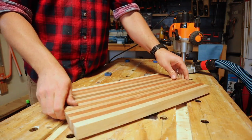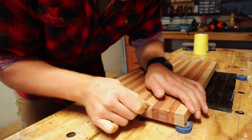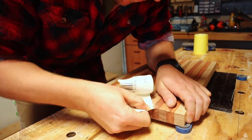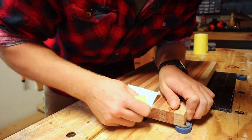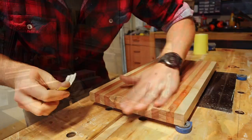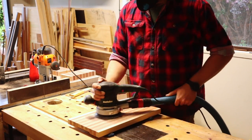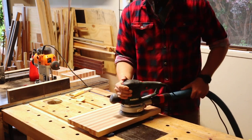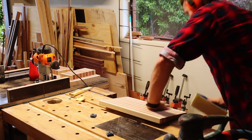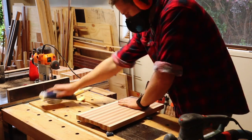And with a dramatic dismount you can now see the grooves in action. Time for that painful sanding I mentioned. As per usual I work through the grits from 80 grit all the way up to 240 grit, being sure to gently break the edges over also. Now as I'm sanding the edges I probably should have gone up and down to match the grain direction of the board, but it's really not the end of the world as it gets tidied up by the subsequent grit.